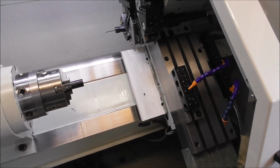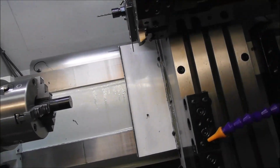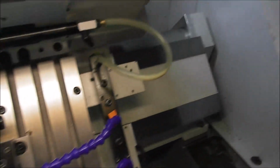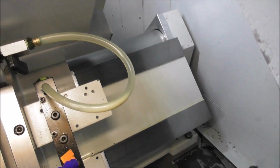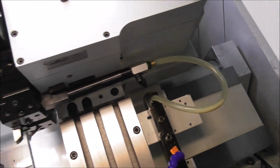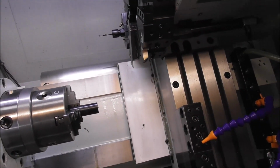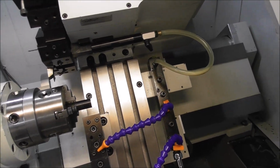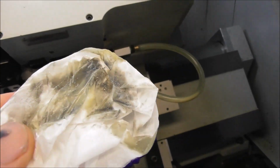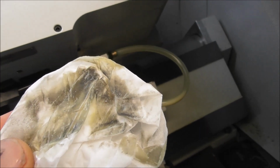So for the Slant Pro, traverse right down one end, the tailstock end, wipe down these surfaces, the 4 sliding surfaces and underneath, and lubricate it with slideway oil. Then come right down this end and wipe those surfaces with a clean rag or a tissue. Wipe off all the abrasive material and dirty oil, put new oil on, as well as running the pressure lubrication system. Obviously this is just an additional backup cleaning and surface application. I've just been running acetyl parts, and you think, oh well, there's no abrasive particles coming off there, but start up in the morning, did the usual wipe, and if you look closely at that, there's little abrasive particles in there, as well as the oil stained with the worn cast iron.